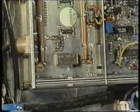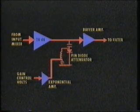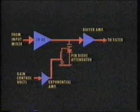Now let's look in more detail at the gain control stage. The input amplifier has a gain of about 28 dBs, and is followed by a pin diode variable attenuator, which has a range of 45 dBs. The relationship between the pin diode current, which determines the amplifier gain, and the control volts at the input, is established by the anti-logarithmic amplifier. This results in a linear variation of amplifier gain in dBs with control voltage.